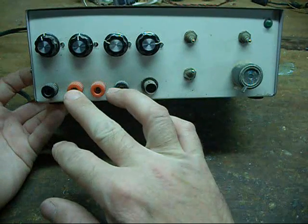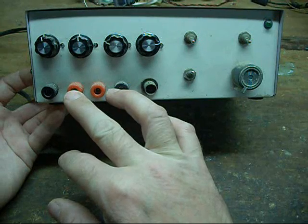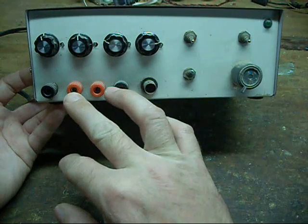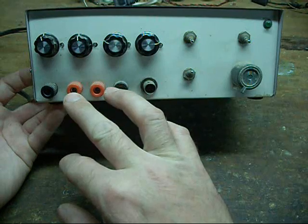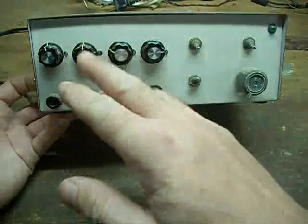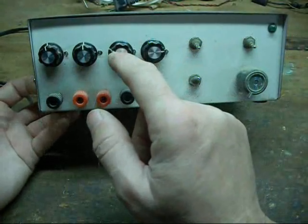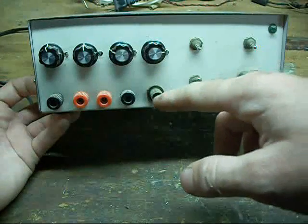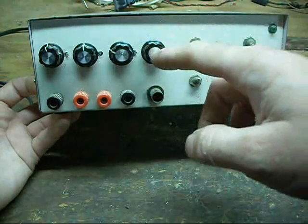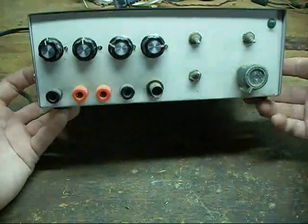It has two outputs of TTL — two independent TTL timing outputs with two independent oscillators. One of them is the basis for the sine wave, and the other oscillator is the basis for the square wave and triangle wave.